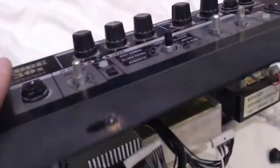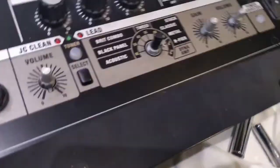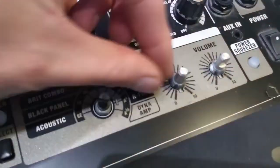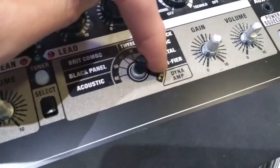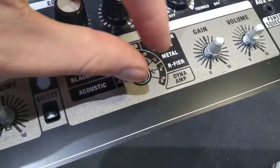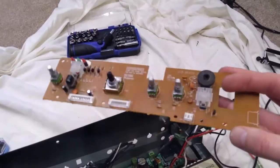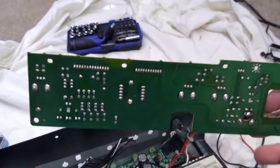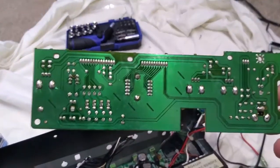The other thing we have to do is get the knobs off up top, and the nuts that are on top. The only tricky one is this middle one for the selector switch - because it's got this little stop here, you just need something open-ended for that one; otherwise a long socket would do the rest. That's now free with a little gentle wriggling, and you can see the nine-way selector and the nine contacts for it on the underneath.